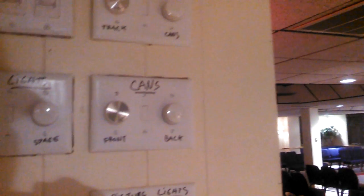Let's go to high. These are all some very good air movers. All three of these fans — I replaced the bearings and varnished the windings, so they should run like a brand-new motor. We'll see how the spin-down time does. I was noticing when I was working on them that for some reason, this one here seems to be going a little slower and seems to spin down much quicker. We'll check that out. There's no reason for that to be the case — the bearings are brand new, literally just bought new bearings.